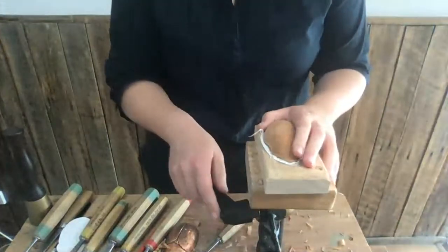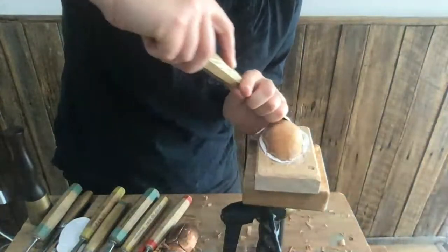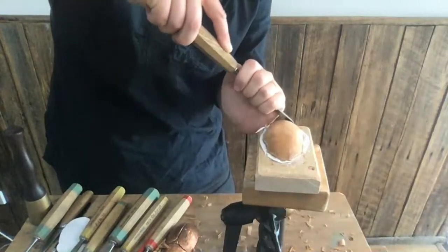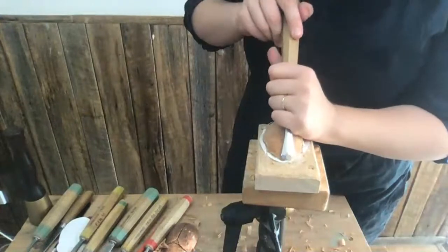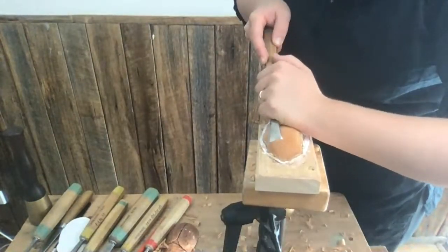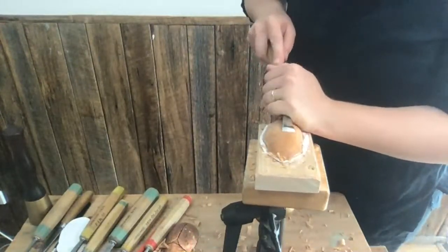Hey, Linda, what other types of timber could be used for this project? Look, anything that's going to carve, basically. That's a silly answer, I know. But anything you could get shape out of. I've used a fair bit of jelutong and American walnut in these live streams. They've worked really well. I've even had quite good success with just cypress, bought from the local hardware store, that was a veranda post. So that's quite an inexpensive way to get some timber. If it's got quite a straight grain without many knots, then it can carve really, really nicely.